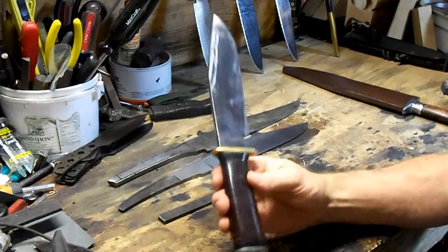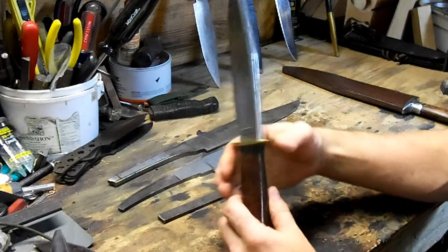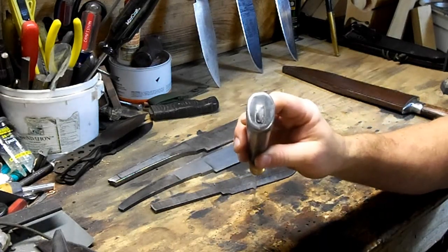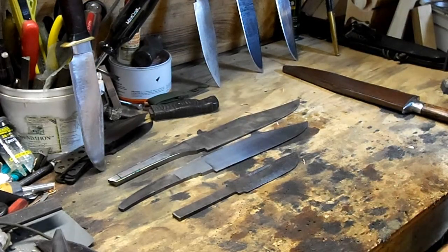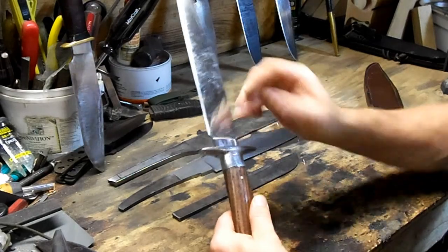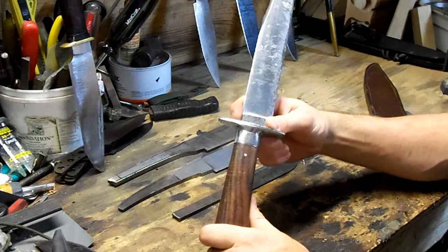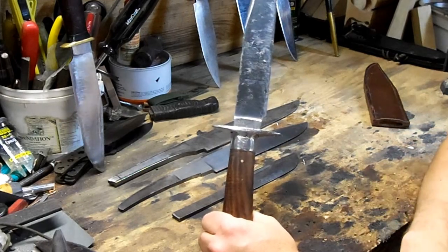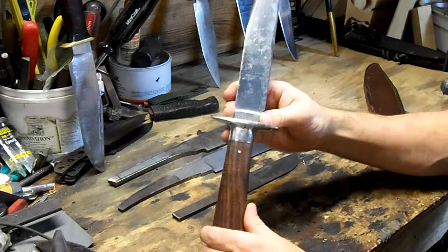This is a narrow tang knife. It's an ugly knife, but I used it very hard for many years. The tang on this is nearly the width of the blade — that's why the handle is a broad oval that fits my hand really well, because that tang is about that wide underneath the handle material. I have it peened at the end. I've done fairly crazy stuff with this knife, carried it for several years, used it in the woods, and beat it through trees. A narrow tang knife makes a really rugged knife. It also makes a knife that is a sealed unit — I call it a totally encapsulated tang. You can take it in the water, clean off the blade and handle. I've sealed this with Acraglas, so you don't have to worry as much about elements getting into your tang. You still have to take care of your knife, but with a full tang you'd have water ingress all over it; with a narrow tang, you get a more sealed unit.